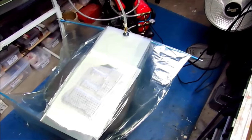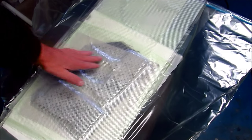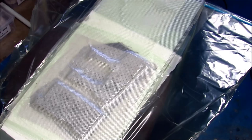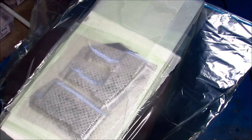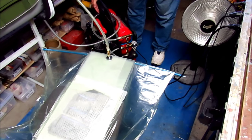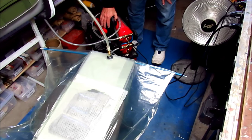We can see the parts pretty good — good detail in here underneath the vacuum. They're warm-ish. We'll walk around the shop over to the other side and I can pull the vacuum. Go ahead and turn the industrial suction off — it's holding at about 20 inches of mercury. We'll release the pressure.